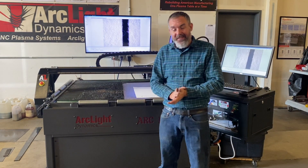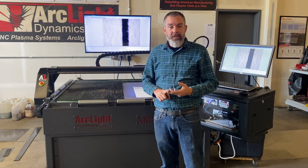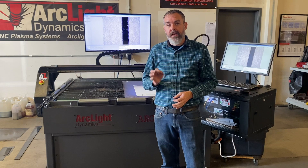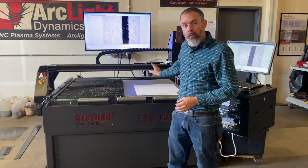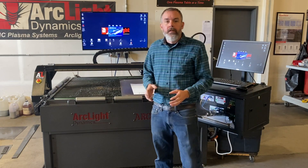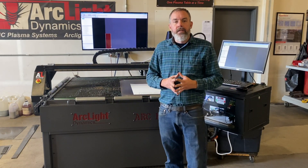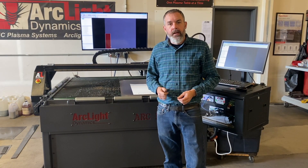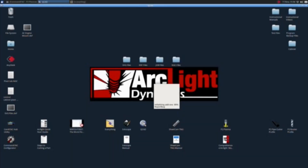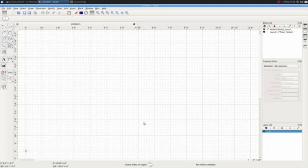We've traced in each of our bolt holes as well as our clearance holes and the perimeter edge. This should give us a full DXF image of what we've traced. Now that we have saved our DXF file, we can import it directly into Sheetcam and just blast it out as is, or we can take it into the CAD program and modify it as needed.